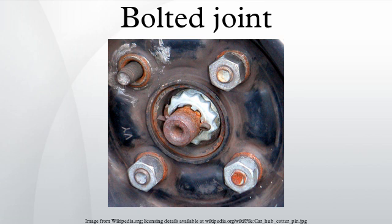Where T is the required torque, K is the nut factor, F is the desired preload, and d is the bolt diameter. The nut factor K accounts for the thread geometry, friction, and pitch. When ISO and unified national standard threads are used, the nut factor is defined in terms of: d_m equals the mean thread diameter (close to pitch diameter), d equals nominal bolt diameter, l equals the thread pitch (equals 1/n where n is the number of threads per inch), μ_t equals friction coefficient in the threads, and α equals half the thread angle (equals 30 degrees), μ_n equals friction coefficient under the torqued head or nut.